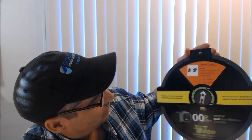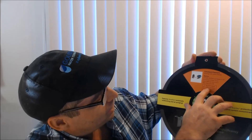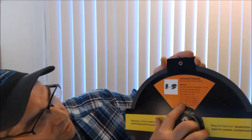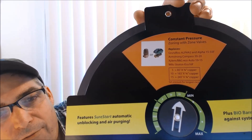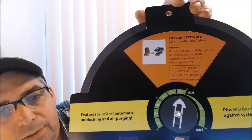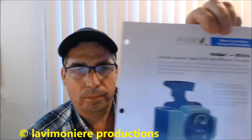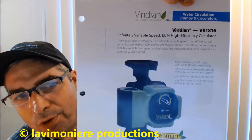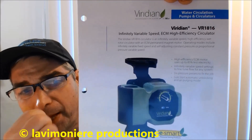If you had 85 feet of total copper pipe and radiation, you'd set it on five. If you had 165 feet combined, you'd set it on ten. And 245 feet, you'd set it on fifteen. If you set this thing all the way to max, the new circulator would run continuously like the new 007. I think this VR1816 variable speed adjustable circulator is very good if you've got zone valves.